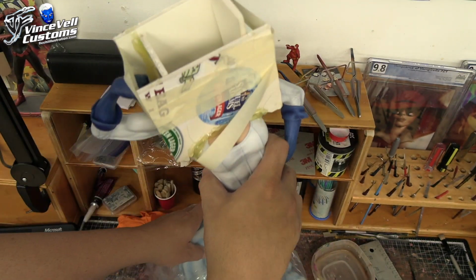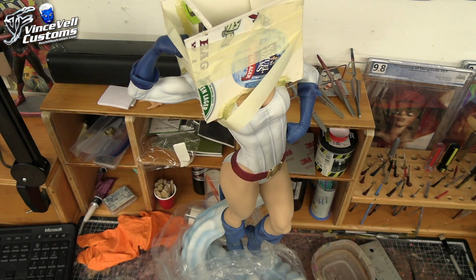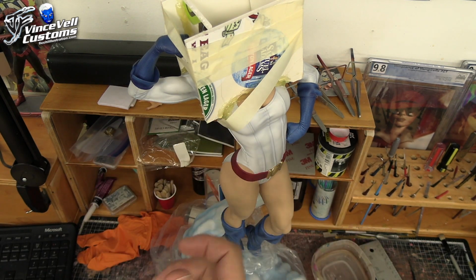I'm not really worried that any of the other areas are a mess. I'm not worried that the box or the mold is in weird shape. That doesn't matter at all. As long as the key is really clean, I can make a nice copy in resin. So I'm just going to put some duct tape around the box real quick. Not any duct tape on the item, because the duct tape I have is super, super strong.